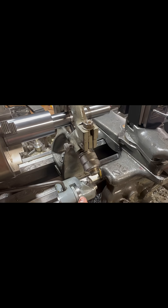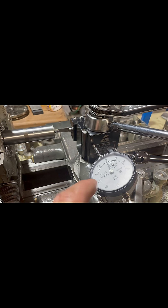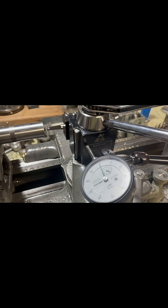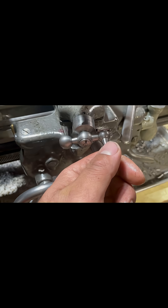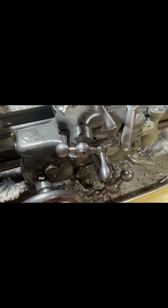I have my stop over here so I know how far I need to go in to begin my threads. The dial indicator is so I can get back to my zero and know where to accurately begin my cut on the inside. I can keep track of it better than these gauges over here, since there is about 20 thou backlash — or maybe 10 to 12 on this one.